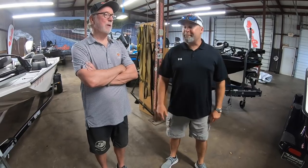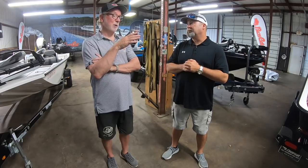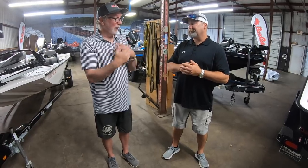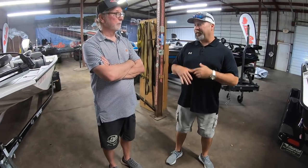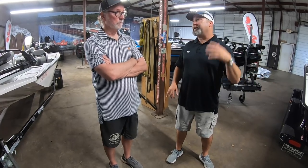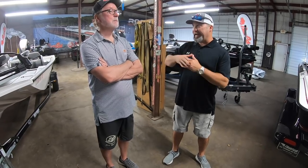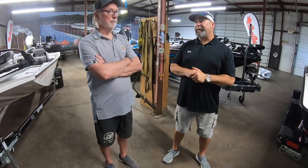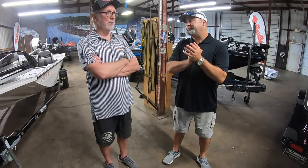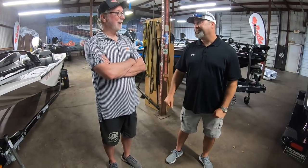So talk to me about when I need to come see y'all again. Specifically, I know I got to change the oil, this is a 4-stroke. I got to do service. So what's my next service step with you guys? At 20 hours, then you need to either come back to us or a recommended Mercury facility, and we need to do the lower unit and do the engine oil as well. Okay. And then after that, it'll be whenever you hit 100 hours, so 80 hours on top of that, and then every 100 hours. Yep. All right, so I don't need to do anything else other than put some gas in it, get some batteries and electronics, and go fish. That's it. I bet it's kind of fast right now.